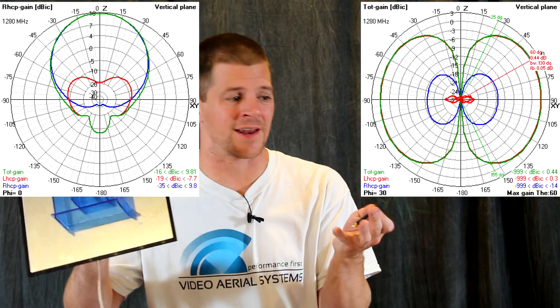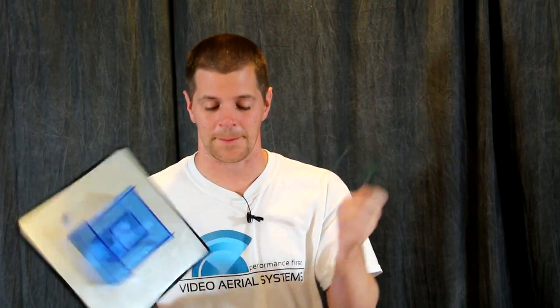So we know what SWR is and how it works — obviously the antenna with the lowest SWR is best, right? Not quite. These two antennas have the same SWR but they're obviously very different. If we only look at SWR we couldn't tell the difference. What makes them different is their radiation plots — one is a long-range directional antenna, the other is an omnidirectional antenna. If SWR were the only thing we cared about, we'd run a dummy load — it's not an antenna, just a resistor, but it has perfect SWR from 2 MHz all the way up to 6 GHz.